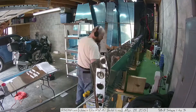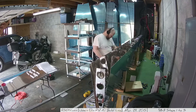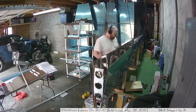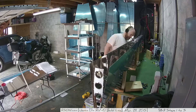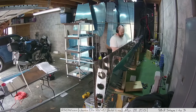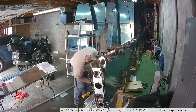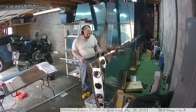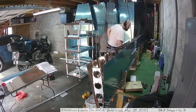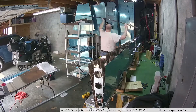Now I'm on to 8-9. This is me working with the little stringers, getting those deburred and cleaned. I've actually gone back and cleaned them even more because they were really rough — I had to cut them upstairs on my bandsaw. Getting those inserted inside, underneath the skin — it's kind of clever how those go in there. My initial impression was that they were going to be an incredible pain, and they actually aren't. In some ways they make assembly later on easier because some of the holes just kind of line up nicely. I have to thank Vans — whatever effort they put into their matched drilling system was 100% worth it. It really rocks and it's amazingly accurate, all things considered.